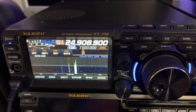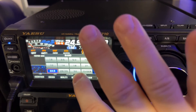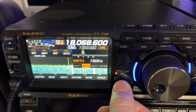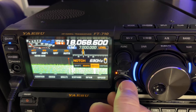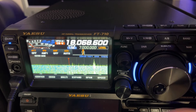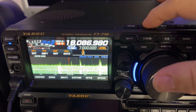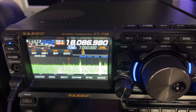There's just a frenzy of activity out there. Oh, there's my buddy Pat — he's on the same summit. 17 meters. With band stacking, you'll only have to do these setups once in a band stack, and then when you return back, it remembers everything. He's on 18086.9. When he sends again, I'll use the ZIN zero-in. Let me lower this.